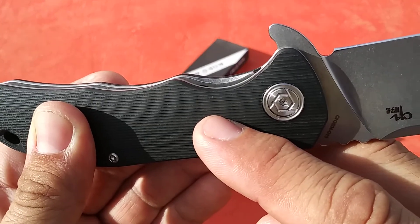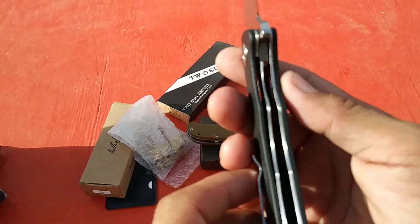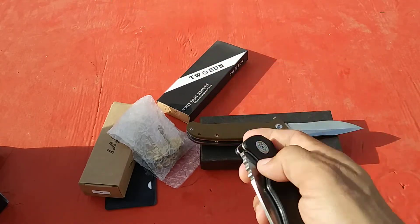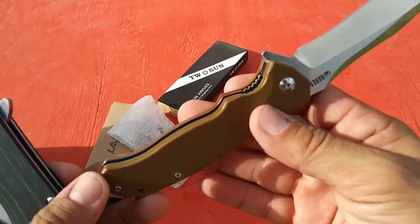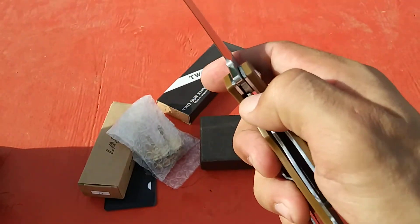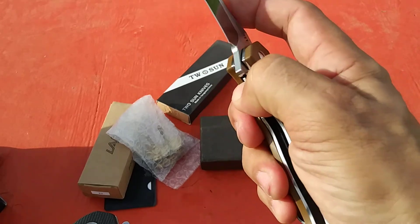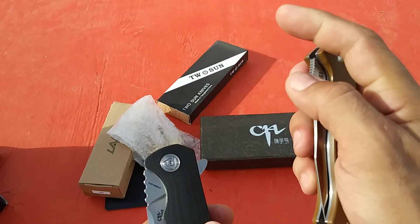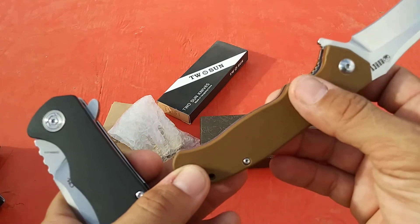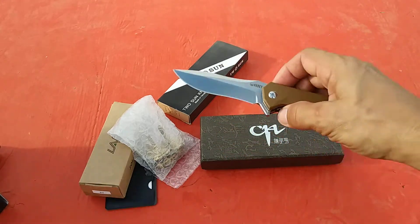I took it apart and sanded down the G10 so it was a little more comfortable in your hand. But what I did do is took this with my sander and cut this down a little bit and opened up this space for the thumb. Dropped it down maybe a millimeter, two millimeters at the most. It doesn't seem like much — if I didn't tell you that I did it, you probably couldn't even tell. But it just gives you a lot more access right there with your thumb and makes it a lot more comfortable to close. That's the one thing going on with this Kubey — there's not a ton of room right there for your thumb. When you push it over you actually have to use the tip of your thumb to get that lock bar over, and with it being jimped on the lock bar it's not the most comfortable thing. So I'm going to do that same thing — cut out the G10, cut out that stainless a little bit, drop it down so you can actually use the whole tip of your thumb instead of just the very point of it.